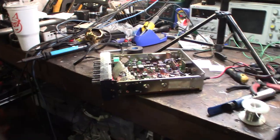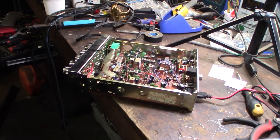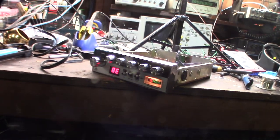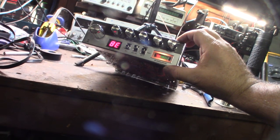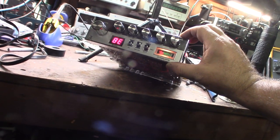All right, this is the nerve-wracking part, so I'm going to put the power supply on and turn it on. If you have a capacitor and its polarity is reversed, it's going to pop right now. I have to back up, make sure my glasses are on. Cool. Looking for some smoke. Yeah, the light, was there a dimmer on this one? Yeah, I don't think so. But it's just not bright, and it's hard to see.